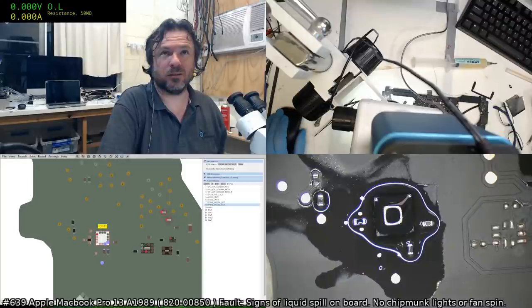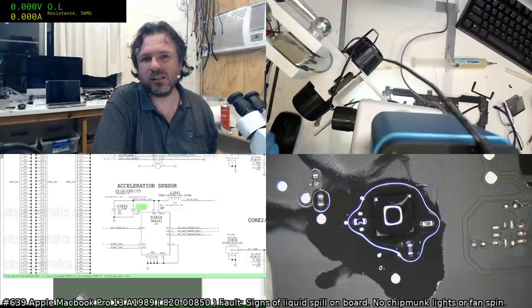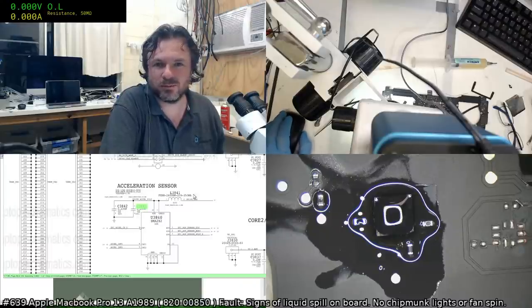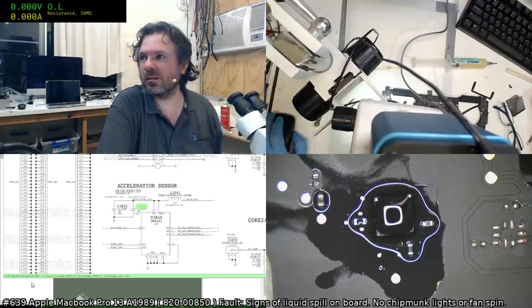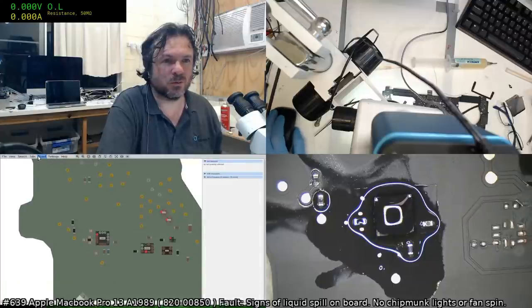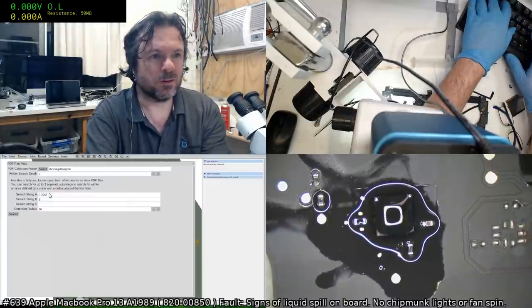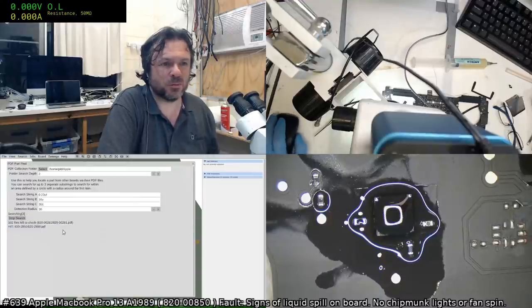That's the cap there. See, it's on VDD and VDDIO, so yeah. I think maybe I'm being paranoid. It's just interesting they actually have a coil, a filter inductor on it. Anyway, we'll find another one of these. Let's see, 22 microfarad, 10 volt 201. They're going to be on pretty much every single board.